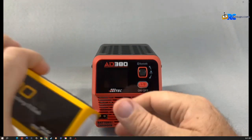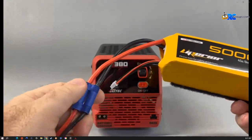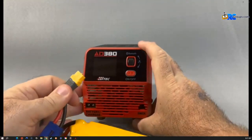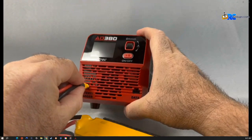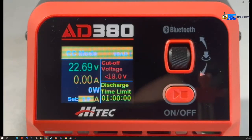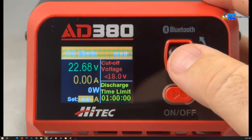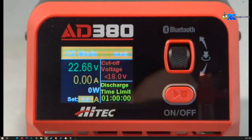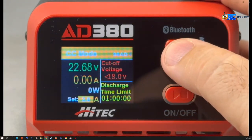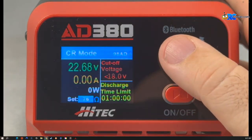You're going to need a battery. For a lot of my packs I'm going to be using an adapter — adapters that go from different connectors into the XT60. You just plug your battery into the discharger, and as soon as you plug it in, the unit is going to go ahead and power on. Now that I have my 6S 5000 pack set up, I can go ahead and start selecting my functions by clicking the center of the rollerball. I'm going to use constant current mode this time — click the middle button and you can see constant current mode is selected.